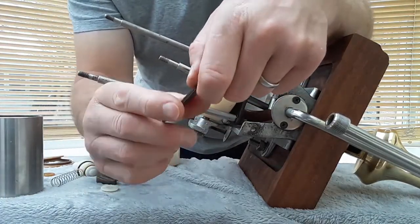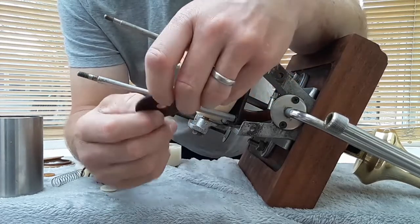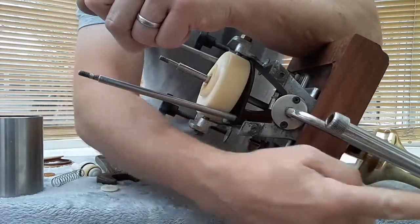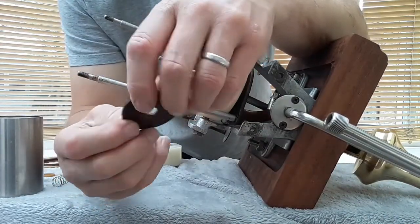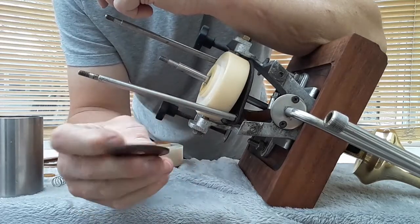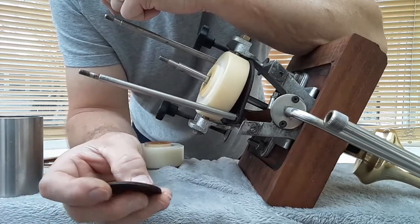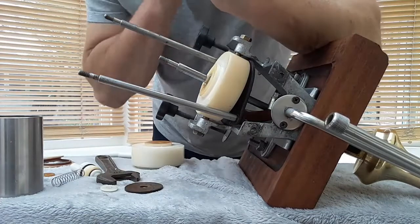Now I know this isn't working properly. I've tried it with water. I couldn't get it to prime, so I couldn't pull liquid through it without using something that I can suck the air out with, pulling the water through the system. And once I'd got the chamber full, the hand pull pump then worked on its own. But this isn't working, as in it's not creating a seal when you're trying to pull a pint. Once I've got the pump primed, then it works. So the flexibility in this is gone. So this needs to be replaced, which I'll do at some point.